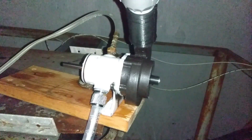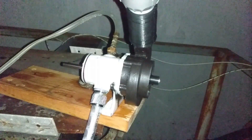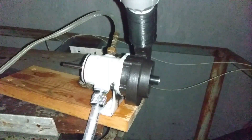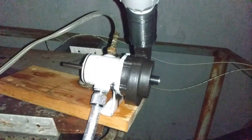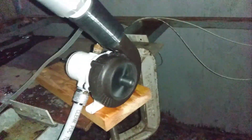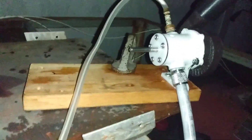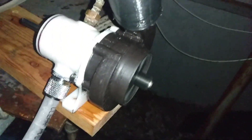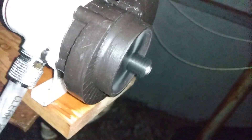After adding clearance for the shaft, I'm back outside for more testing. It got dark on me so some footage is a bit rough, but overall I ended up running it for about an hour with no significant failure — although with much more leakage. That should be easy enough to solve with a slinger on both sides of the housing. I also moved the water dish upward to see if higher pressure would help or hurt, but it only added to the leakage, so I moved it back down. With no significant issues and not a huge amount of wear, I have good design cues to improve on.